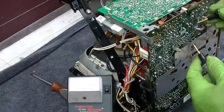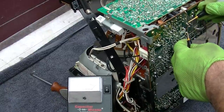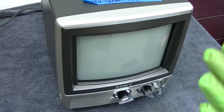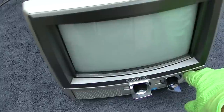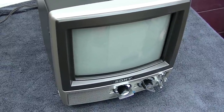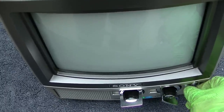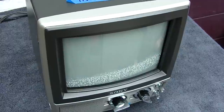So I'm going to go through and test the rest of them. That's the main filter. It beeps above or below a half an ohm. I went through this one and didn't see much flickering at all in the 50 hours I used it, so I'm going to say it's a CRT issue. It's more of a show-and-tell. Great convergence. I think it is a CRT issue — might be a little soft though. Anyway, let's take a look at the bigger one.